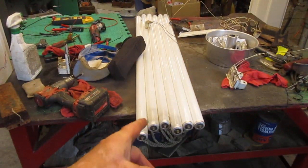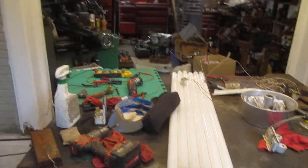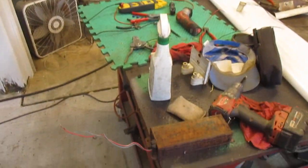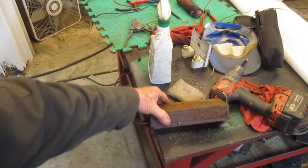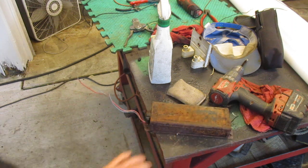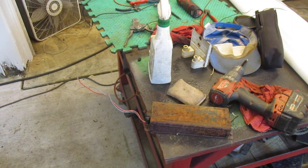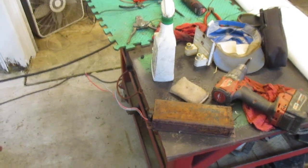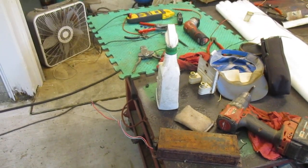Those light bulbs were in the area I'm cleaning out, so I cleaned them out and said I'd put new bulbs in there, even though I didn't think it was the bulbs. I put new bulbs in and they didn't come on, so I opened it up. As soon as I saw the ballast there was no question what the problem was — the ballast is all burned out. These are indoor lights being used outdoors, so they tend to get messed up. You can change one out pretty quick but you've got to take all the shade stuff off on both sides.